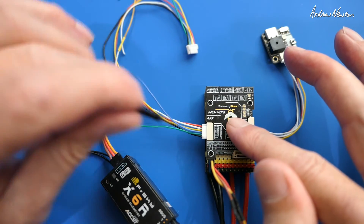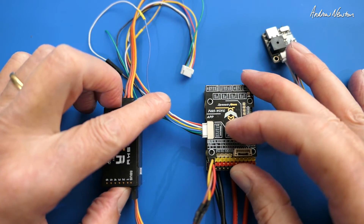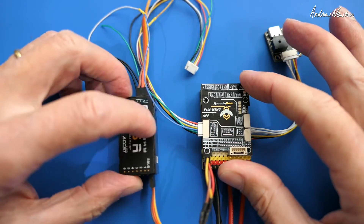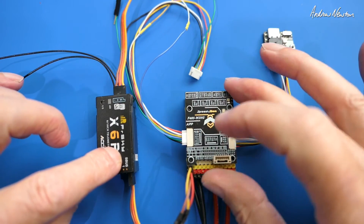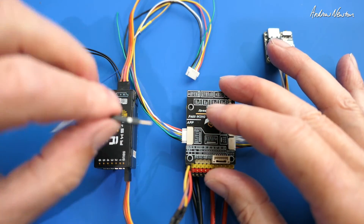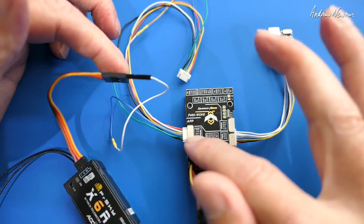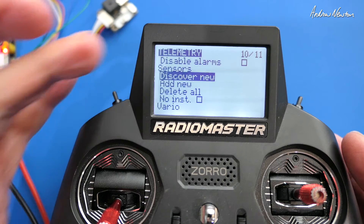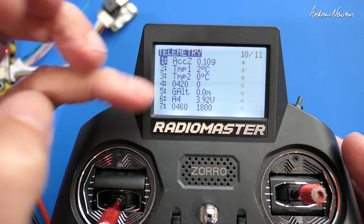That's where soft serial comes in. Soft serial is a CPU-based or software-based UART, not a built-in UART. With the right firmware you can enable soft serial, which gives you an inverted TX pin. As the board came, soft serial was supposed to be supported but wasn't properly implemented. We need to flash new firmware provided by SpeedyBee that enables soft serial and SmartPort telemetry. I have a link in the description to a blog post explaining this with a link to the firmware. Hopefully SpeedyBee will make it widely available. Once the new firmware is flashed, connect SmartPort to the T2 pin, power up, go to telemetry, hit discover, and you should get all 22 telemetry items.